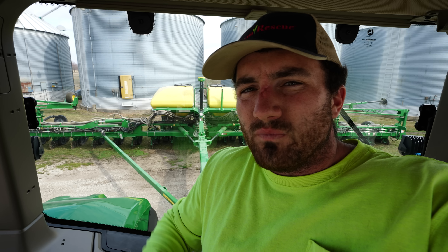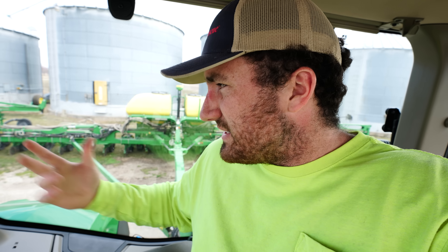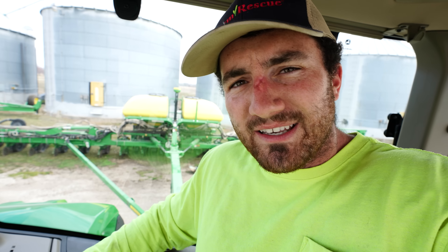With the new planter tractor and adding the implement steering system, the one thing I'm unsure about is our row shutoff settings. The mechanical time delays I've set the same, but the tractor has different offsets in the monitor, the planter's got different offsets, and I don't know what adding the secondary dome even changes. So once the guys from Alliance Tractor come out here in the next minute or two, I'll probably have a conversation about that with them. If it does change things we might have to consider re-establishing our shutoffs before the season, because there's nothing more embarrassing than gaps out in your corn fields.